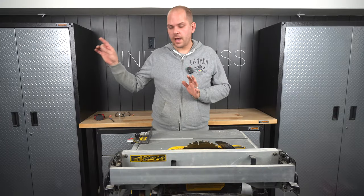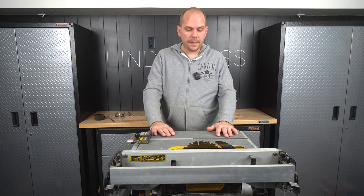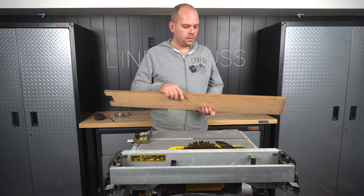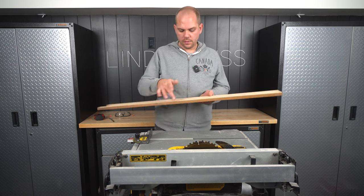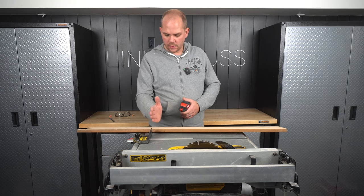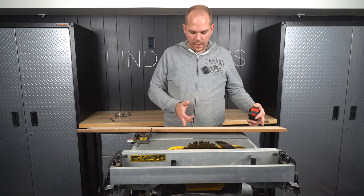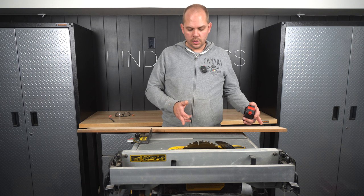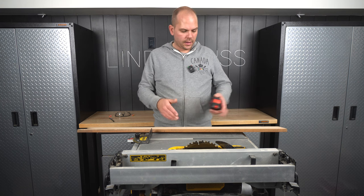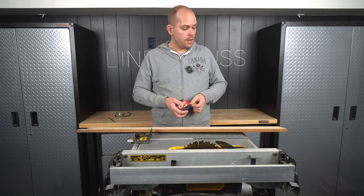I am letting the glue dry over there on the other pieces for the towel rack. I'm gonna work on the little fruit box. So we have this guy all planed down. I'm gonna just clean up these two edges. What I'm planning is to cut 10 inches and 10 inches, and that's gonna make the little V bottom. And then this I have on the side here to make the ends. And I just have to see what this looks like, and then I think I'll just cut this board in half, and we should be pretty much bang on.